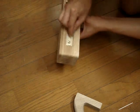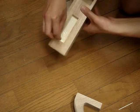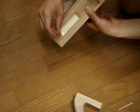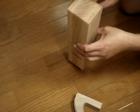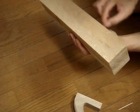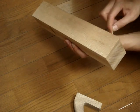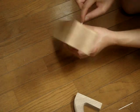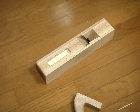If you've got a really tight fit and you put glue in, it's going to swell and you might not be able to get your tote in. That's one reason not to get a super tight fit — get it tight enough so you can easily push it in and back out without too much effort. Mine's actually a bit loose in places, but that's mostly glue.